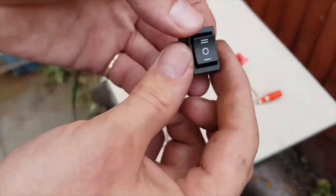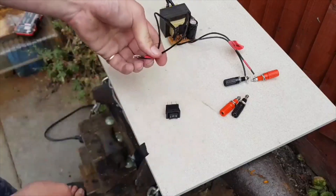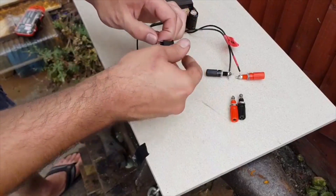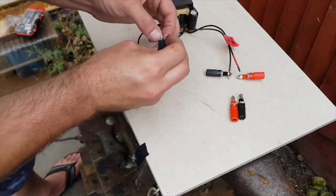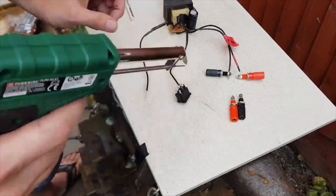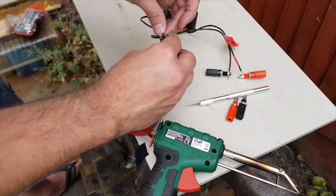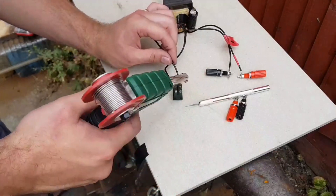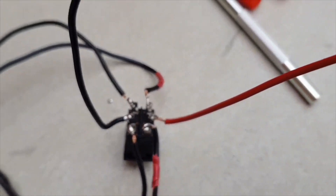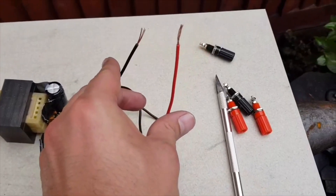Both are now wired up and identified, and I'm going to connect them to this little three-way switch. It's important when doing this to keep all of the positive wires down one side — both the positive for the etching and the positive for the marking go on one side at either end. The outlet wire goes into the centre, and that then chooses between which circuit you're closing and whether you'll be delivering DC or AC. Take your time and make sure none of the wires are touching each other. You can see this little spider of wires, with red tape marking each of the positives running down the same side, giving you a nice positive and negative outlet.